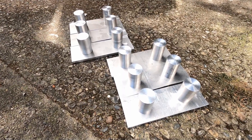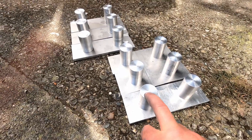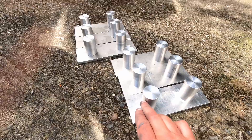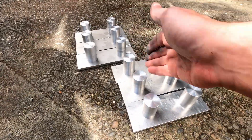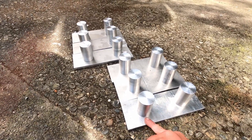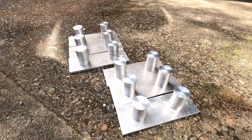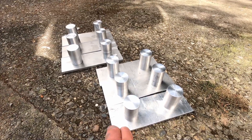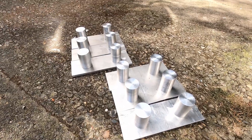We now have the 12 pillars at 57mm high, so the next step is to mark out 40mm high and do a little mark — that's where I want the top piece to rest — so I have a clearance of 40mm from the bottom plate up to the top bar. I'm also going to round off these corners to make it look a little more aesthetically pleasing.